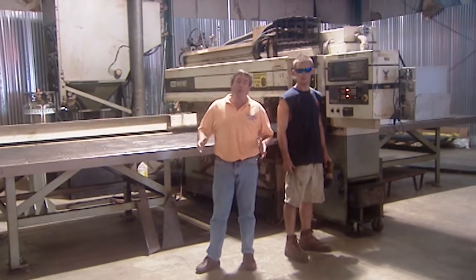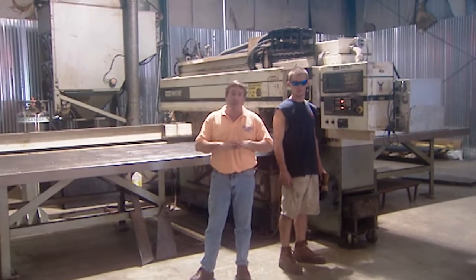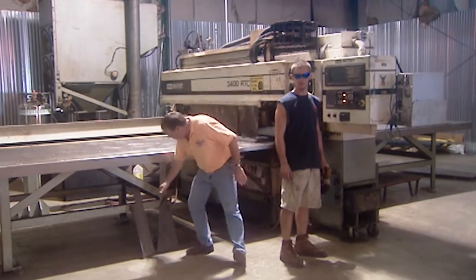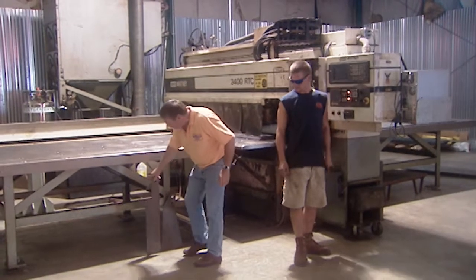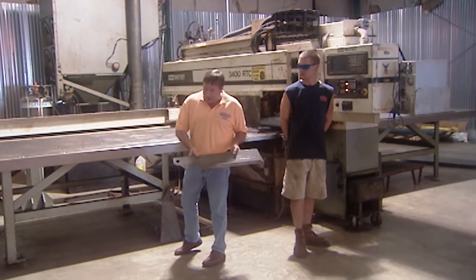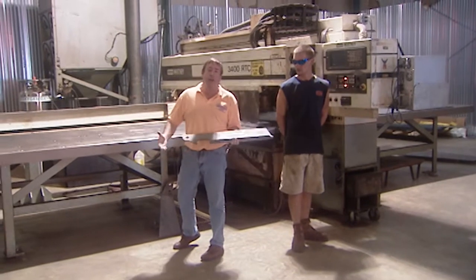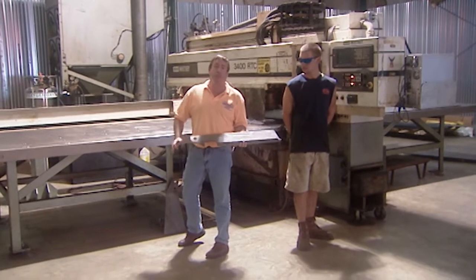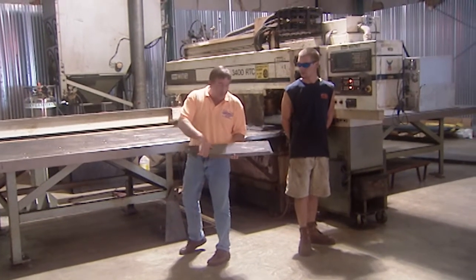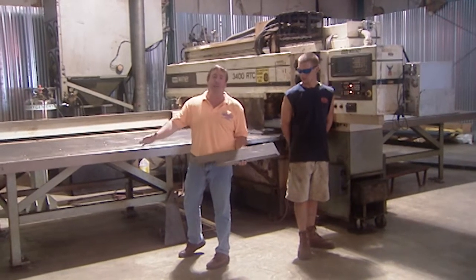This does the brute work of the metal fabrication, from taking the metal from just a straight plate into different parts. Now, these have been through the press brake, but this gives you an idea of what we're going to show you what it can cut out. So the good part about a Whitney is it's a punch and a plasma. So it punches a perfectly round hole, and then it cuts out the part perfect for easy assembly and making all kinds of things.